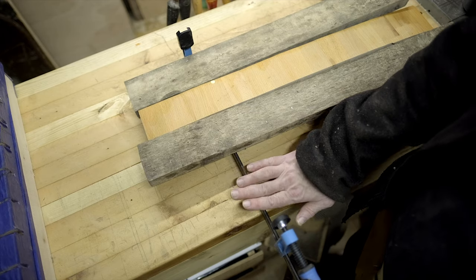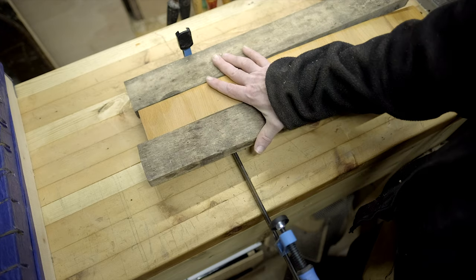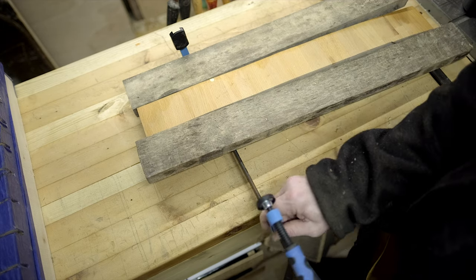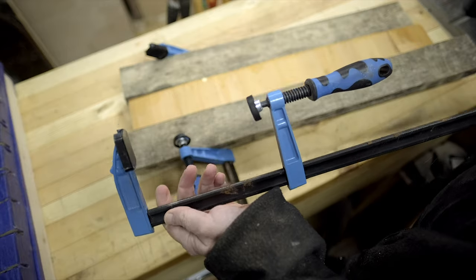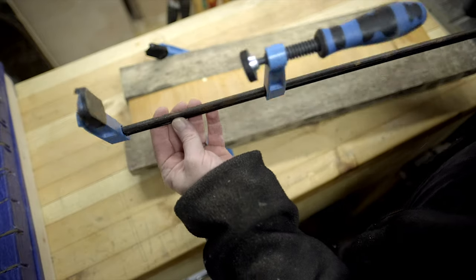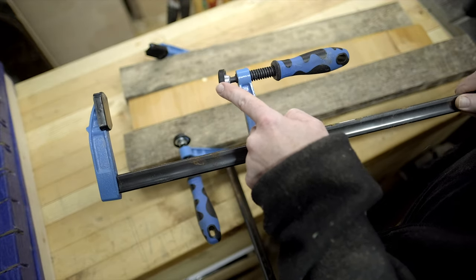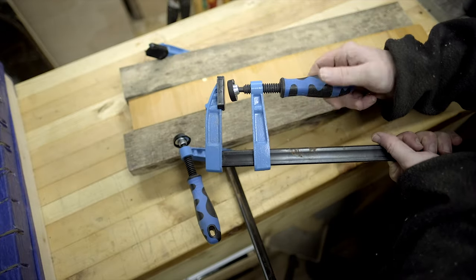Let me show you a little bit more and then how we're going to fix that. When you have a parallel clamp, the bottom clamp will be able to stand up by itself and you can lay out your boards that you're going to glue up. You'd lay them on there, push the bottom clamp on, then tighten up. Because they're parallel, two things occur: it doesn't have this thin bar, so it's not going to fall over every five seconds, and the screw tightening piece is positioned correctly.